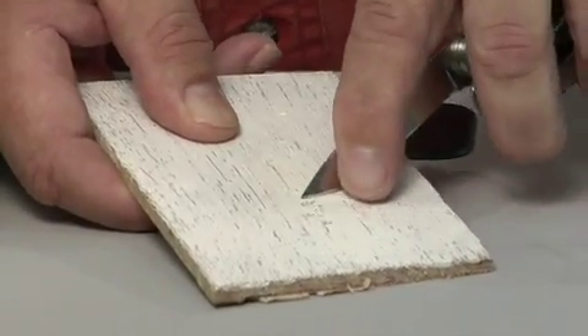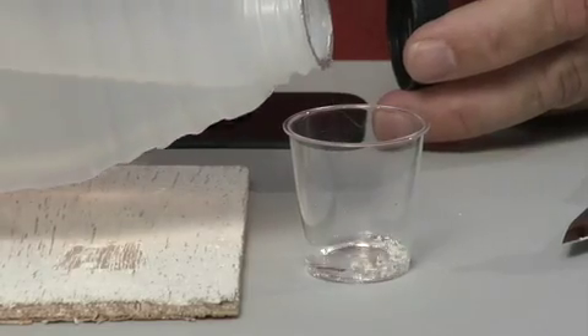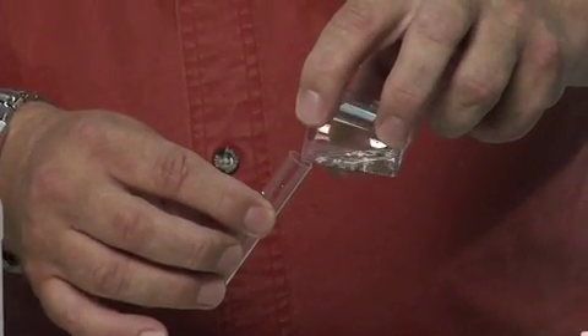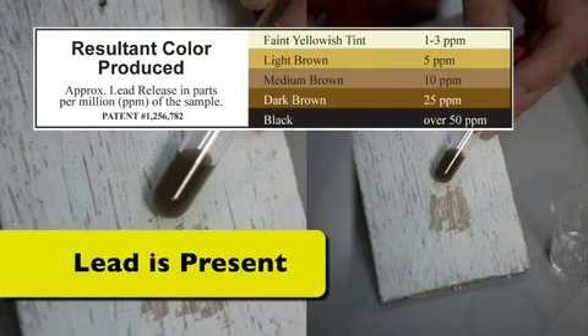For testing thick paint with multiple layers, take a small paint chip or scrape off a sample from an inconspicuous place and allow it to sit in vinegar for four hours. The vinegar is a mild acid which will penetrate the inner and outer layers and dissolve lead if there is any. Then test the resulting vinegar with the indicator solution and compare the color produced to the chart enclosed in your Lead Inspector test kit.